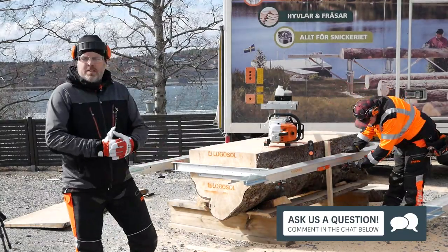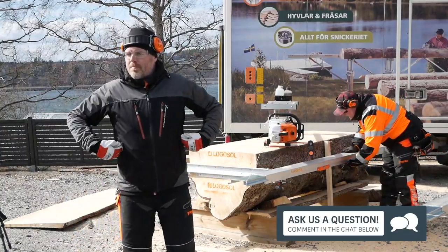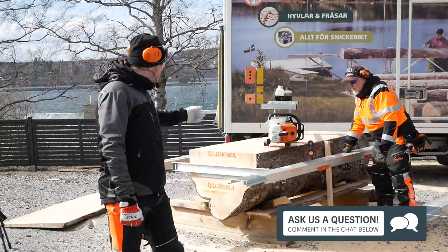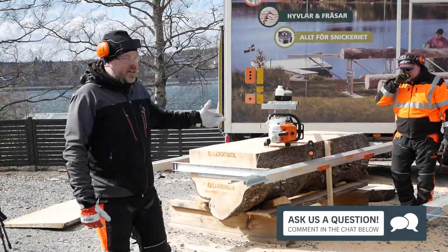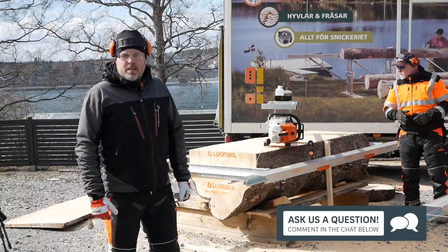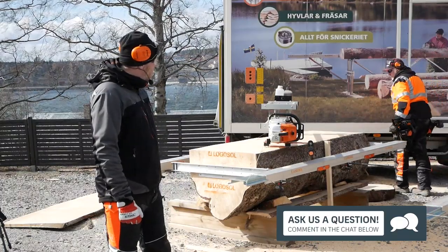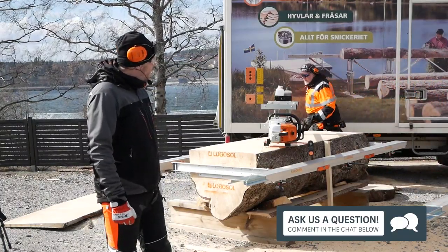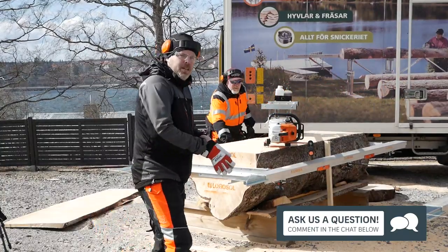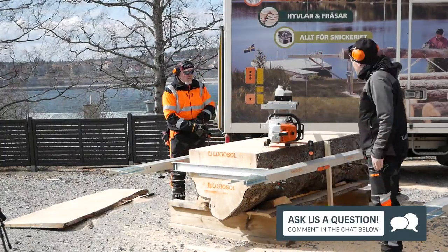Yeah, we have questions. Does Logosol sell ripping chains? Yes, we sell ripping chains. This chain that we have on here is the Oregon Hyperskip ripping chain. It's a 0.404 inch pitch, and I think I'm gonna show you actually, it's kind of a special chain.